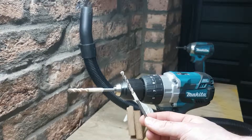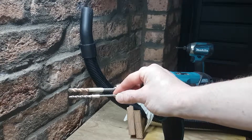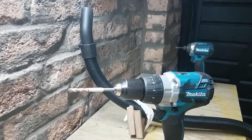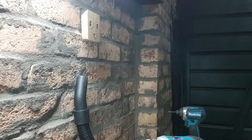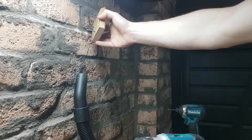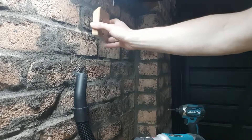A few more quick tips for drilling in masonry — particularly rough masonry like this where accuracy is going to be tricky but fairly needed. I've already done the pilot holes using about half the diameter of the bit for the final plug size, and marked them off with tape to the exact depth of the plug. That's going to allow more accuracy with the holes and guide that larger bit in. On top of that, dust extraction — getting red dust everywhere, not fun — so just like wood I've got the vacuum sucked up to the correct position. I've been able to test using my pilot holes that they are all in the right place. This one here I've noticed is a tiny bit too far over, so when I come to do the bigger diameter hole I'll just put a bit more pressure on that right bottom corner and that'll drag it ever so slightly to where it needs to be.